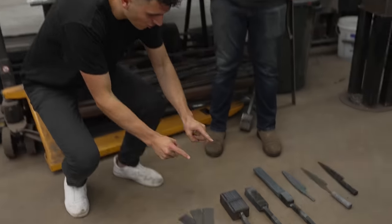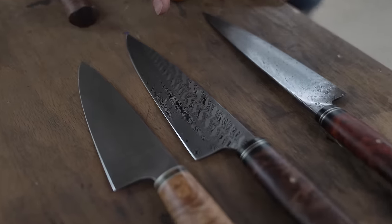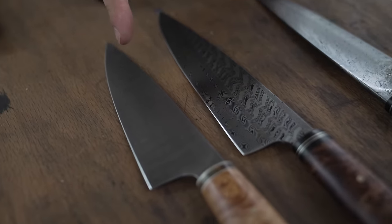Today we're gonna learn how to make Damascus knives and we're gonna go all the way from this to this. This knife has high contrast Damascus, whereas the one next to it I've removed the contrast. It's a chemical compound essentially that's producing that contrast — when you've made Damascus it's two different steels. When you finish the blade you etch it in acid and the etching eats away one of the steels more than the other, so there's a topological difference. In that process it also deposits a layer of black iron oxide.